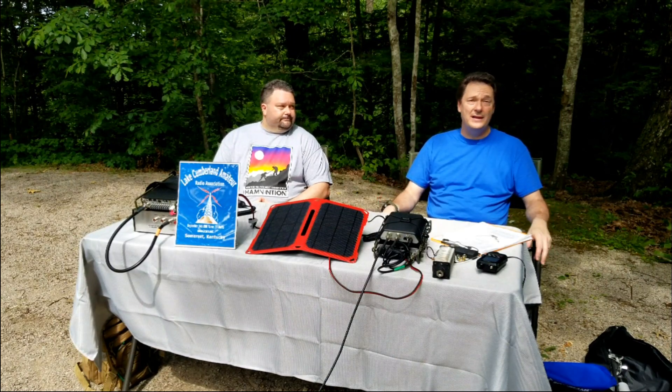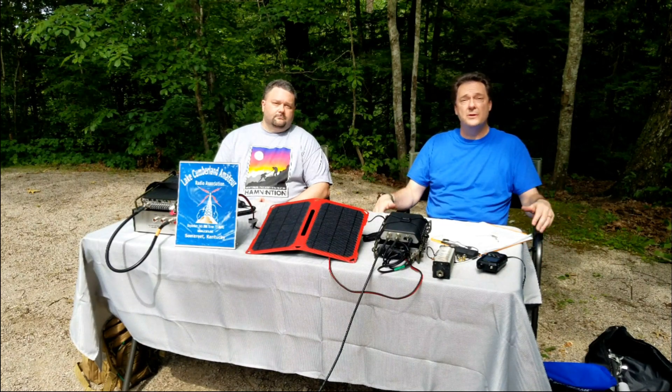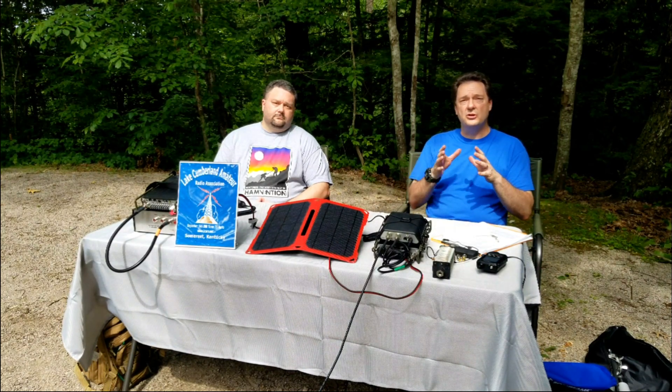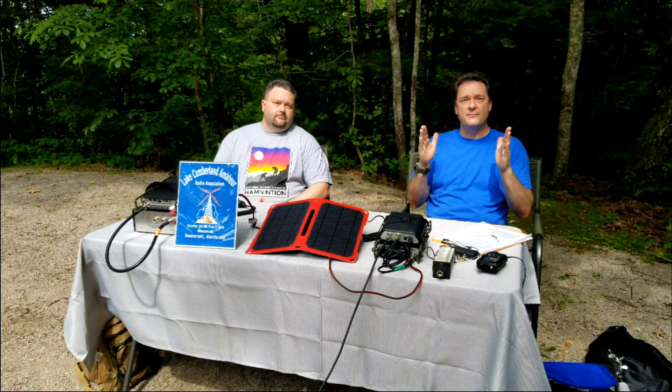So we're back now. You can see what the setup looks like — it's actually quite easy. I've probably set that particular antenna up a couple dozen times on different road trips and testing it out. What Chris and I also did once we had it set up is we took the coil off. Right now we're just set up for 20 meters, and you don't need the coil with the jumper for 20 meters.